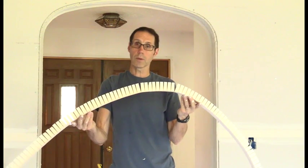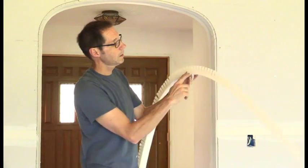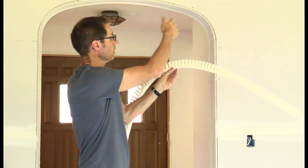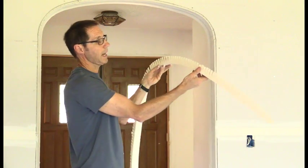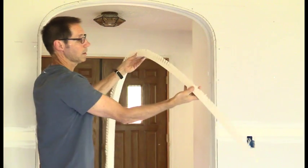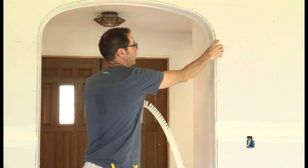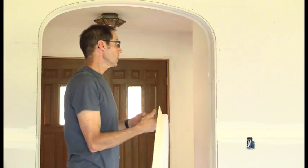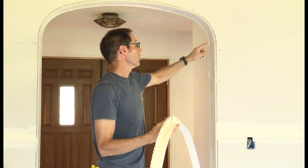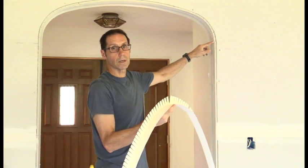You can buy corner bead already made that will bend right around any archway. The one edge that needs to expand as it goes around the arch has little curves cut out of it — about every half-inch or three-quarter of an inch. I actually cut the archway bead so it's a little longer than the archway. I like it to come maybe about a foot past where the archway starts, so I can blend it in a little better. The only exception would be an eyebrow arch — then you'd probably want to stop your flexible corner bead right at the start of the curve.